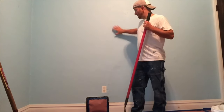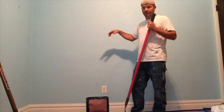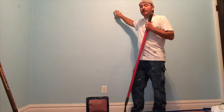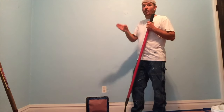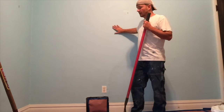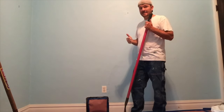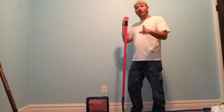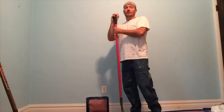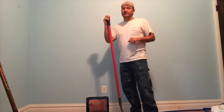One of the things you really have to consider before you start knocking this down is what is on the other side. If this is a total gut rehab, just plow on through. But on the other side of this wall is a finished bedroom that's already been done — we're doing one bedroom at a time. So I have to be very careful when hammering because I don't want to damage anything over there. Two of the walls in here are outside walls going to stucco, this wall goes into a bedroom, and another wall goes into a bathroom, so we need to be cautious there as well.